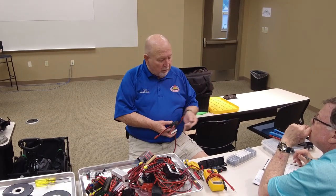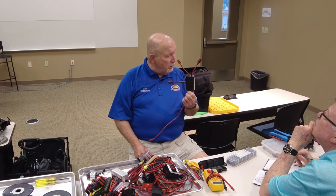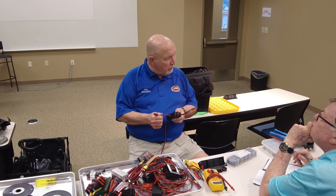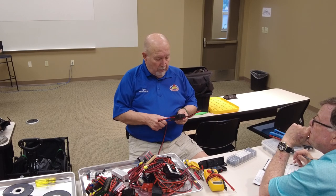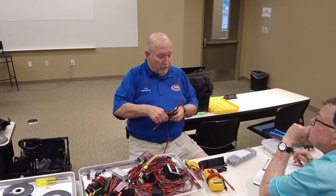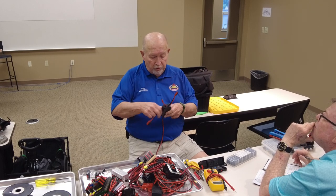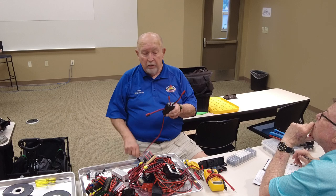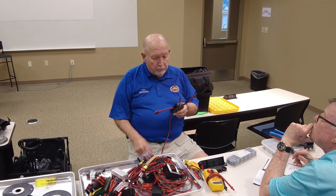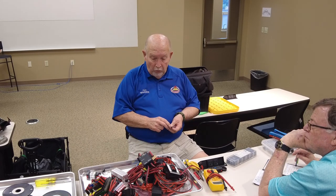It's just got two of these in there. They both connect to the B plus, and the load parts of this connect to here. So as long as you've got B plus, it's just going straight to the load, and with whatever size resistor you've got putting current to your battery. When you lose your B plus and the power goes out, then the battery comes automatically back to here and powers. So these are things you can do with power poles.